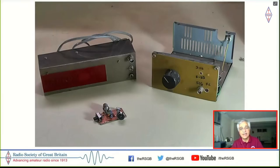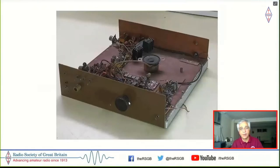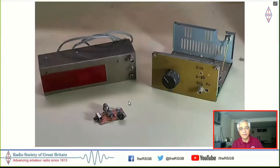And on the other side, I had an RF probe which was used to see the slopes of the crystal filters. And this got me going with a number of things, including being able to measure inductances of any coil that I wound. That was actually a fairly simple thing to do. I probably have a picture of that somewhere.